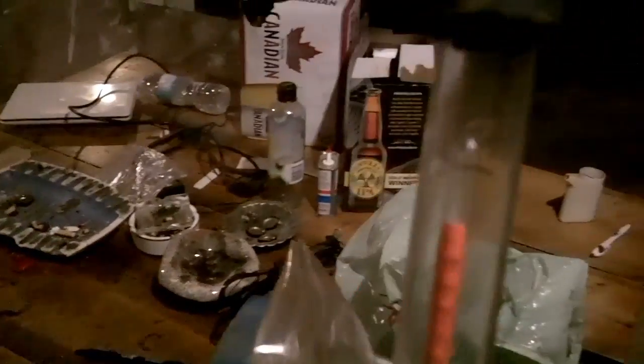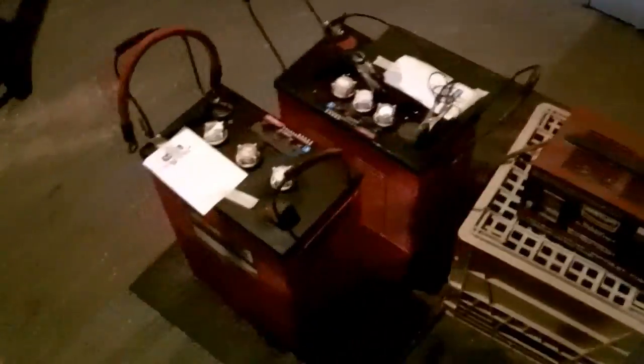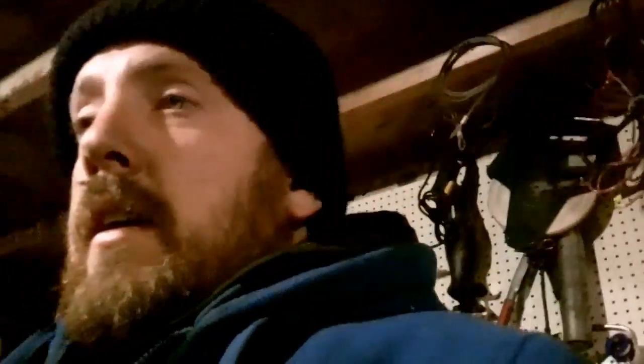The specific gravity is coming up. These started off deep in the red, now they're getting into the white, and soon we'll be into the green. There are specific measurements these batteries are supposed to be at — 1265 — but they started at 1150, so that's not good at all. Like I said, just blasting them and letting them charge, probably for close to a week each.